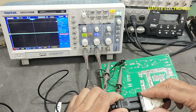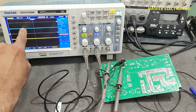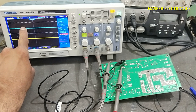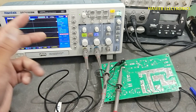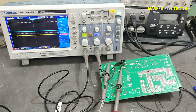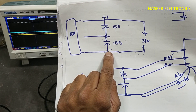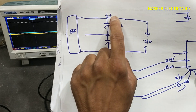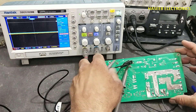Now let's measure the signal. You can see that this time one signal is on the upper side and the second signal is on the lower side — 156 volts on the upper side and 156 volts on the lower side, so the total voltage is 312 volts. This is the second condition. One capacitor is giving a negative voltage because the reference point is higher and more positive than that measurement point.